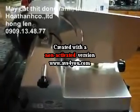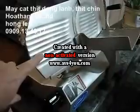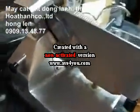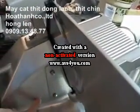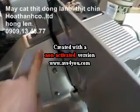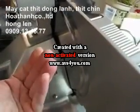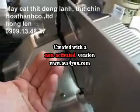Slicer basics. Now there are different types. This one here is a little 9-inch. This is a 12-inch. They have a lot of things in common, and not all of them have the same angle. This one below is a belt drive, and that's one of the reasons why the angle is what it is. You'll see some manufacturers almost have it straight up. Oftentimes there's a gear drive.